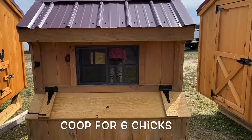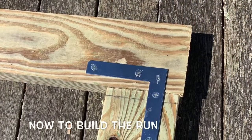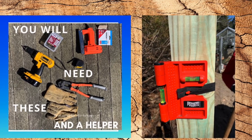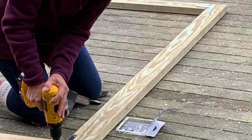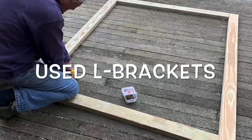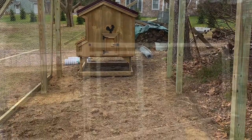We bought this chicken coop from Agway. It's big enough for six chickens and has four laying boxes. So now we have to build a chicken run for the coop. We used these post hole diggers to dig the holes for the four by four posts, and we're going to attach the frames to those posts. We made two frames, 12 feet by six feet, and stapled chicken wire to them. We set the four by four posts in with dirt and rocks — no cement.